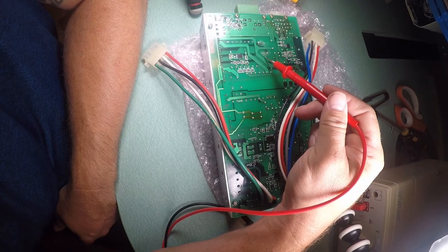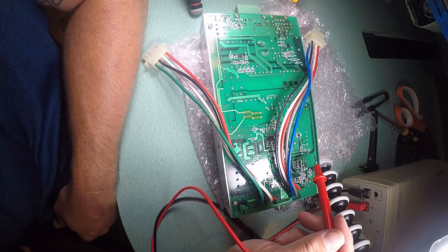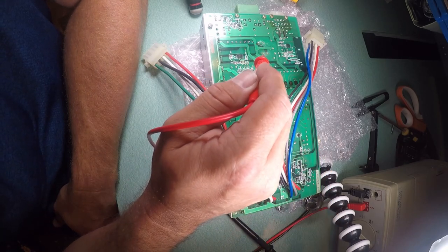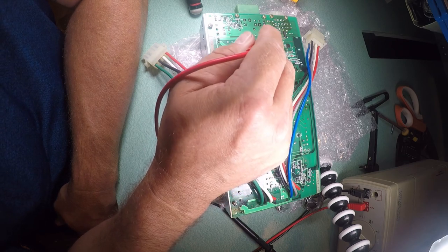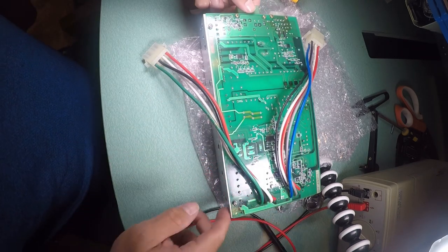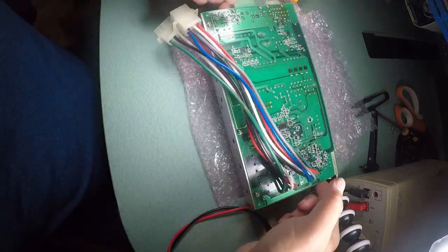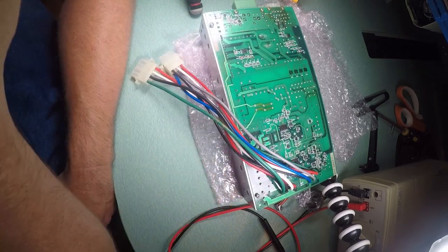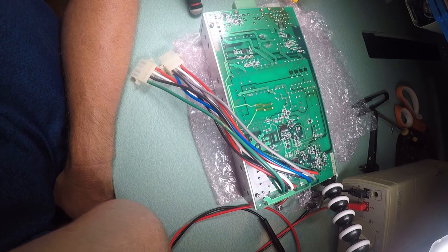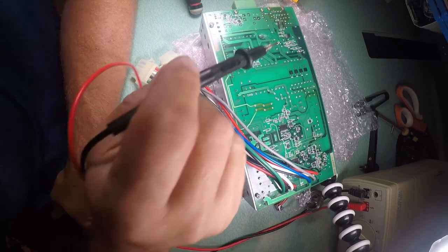This is kind of odd. It shows a little bit of potential leakage on these capacitors. So I would like to not see corrosion here. And that suggests maybe I do have some capacitor issues. So let's flip this over and look and see what's on top of this. Yeah, I've got a little bit of capacitor leakage going on here. So I would like to not see that. But this is nothing that couldn't be cleaned up.